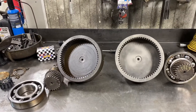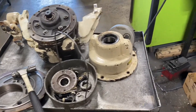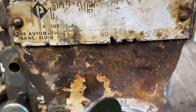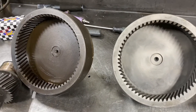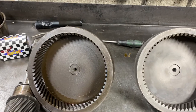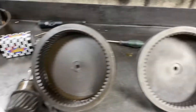What I'm going to talk about now is this Paragon I'm working on, a P44R. R stands for right hand, and somehow this got out of the factory where the left-hand gear set is installed — it says right-hand rotation, and it's a P44R. The four means it's a 400 series transmission. The second four means it's a two-and-a-half reduction. This is a 1977 36-foot Chris Commander. One thing on Paragons is the reduction is different for the rotation, so a left-hand rotation has a different reduction gear set than the right-hand rotation.